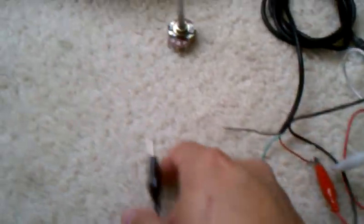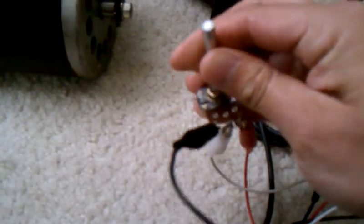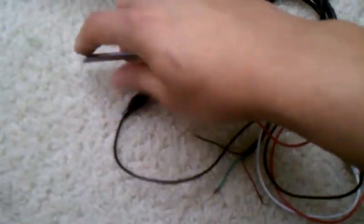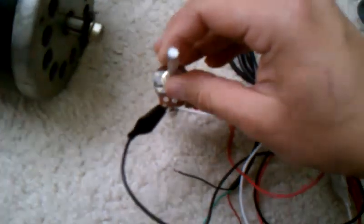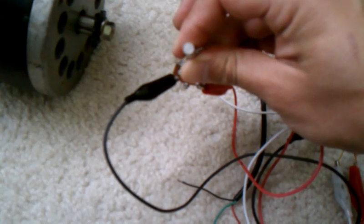But I'll show it with the potentiometer also. All I need to do is hook up five volts to one side, the negative or ground to the other, and then the signal just needs to be the middle one here. It's going to be going from zero to five volts as I turn the wiper. This potentiometer doesn't seem to be working very well, because I turned it quite a bit before it started doing anything.